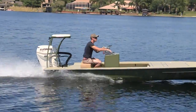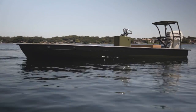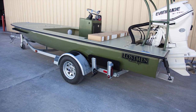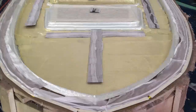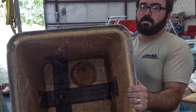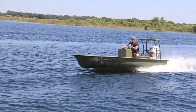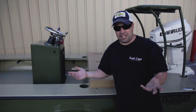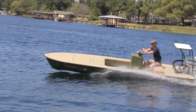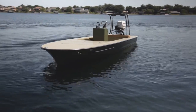Now, the real cool thing about this boat is it's all-Aramid — it's all Kevlar. Some manufacturers do one layer on the hull, some just put a piece in and say 'made with Kevlar.' What we do is the inner and outer laminate on the hull, the deck, the liner, the cockpit, the hatches — everything is all Kevlar. We actually dropped the weight down, so he saved weight on the material and on the resin. By going to that material, that's how he was able to achieve the weight savings. A rough estimate — because everything is measured by weight in the composite world — is we think he saved about 150 to 160 pounds. That is a good number when you do it all around, as opposed to just doing the hull.